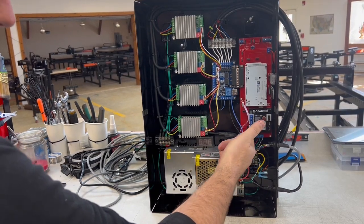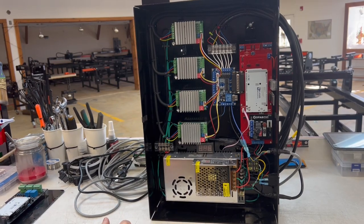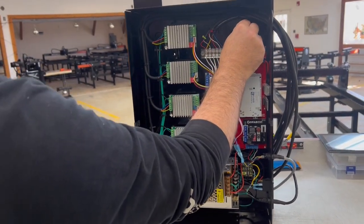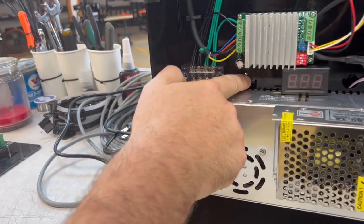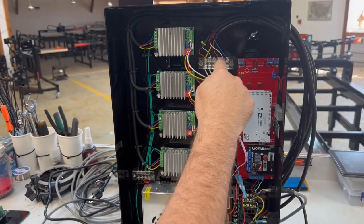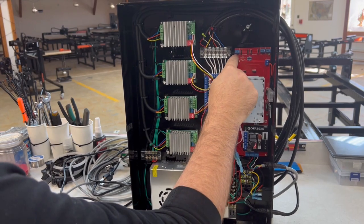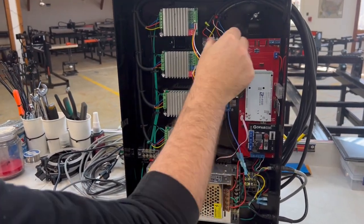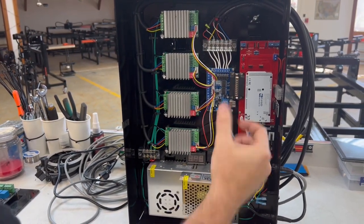And if you have a 6-position screw terminal that's down here that looks just like this one, that's also going to get removed. To do that, we have to remove this nut here, and this nut, there would be a nut down here too, so that we can pull this panel out and get access to the nuts on the back of these. The rest of them we're gonna leave. So when we take this off, we're gonna leave all those standoffs in place, but we need to get access to the back in order to take this off. And if you have that one down here, same thing.